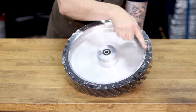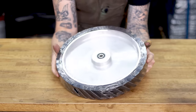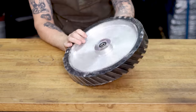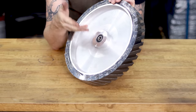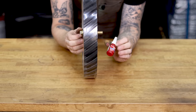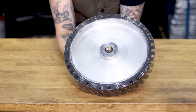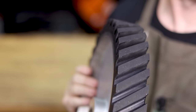This is the wheel I got from AliExpress — 350 millimeters across by 50 millimeters wide, which equates to about 14 inches and 2 inches. Overall construction seems really nice and pretty solid; the machining is not the best but it's gonna get messed up anyway, and the bearings look pretty good and spin okay. The one downside is that they do not have an internal spacer between the two bearings, which means when you thread in your axle bolt there's a possibility of side load. That's why we use the brass spacers and the Loctite — we'll make sure not to over-tighten this bolt, so it won't side-load those bearings.